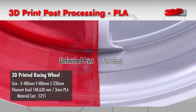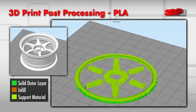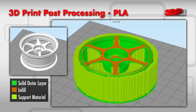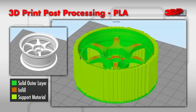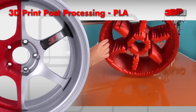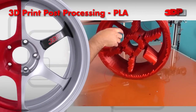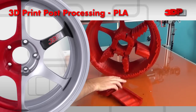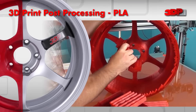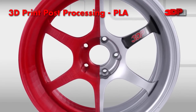This rim was 3D printed using a commonly used plastic called PLA, polylactic acid. The part was relatively inexpensive to print, costing only about $250 in material. The model modifiers were set prior to printing to ensure a strong part with enough infill and wall thickness to enable post-processing. The part also needed a considerable amount of support structures due to the steep overhangs in the model. When the print was complete, the breakaway support structures needed to be removed.